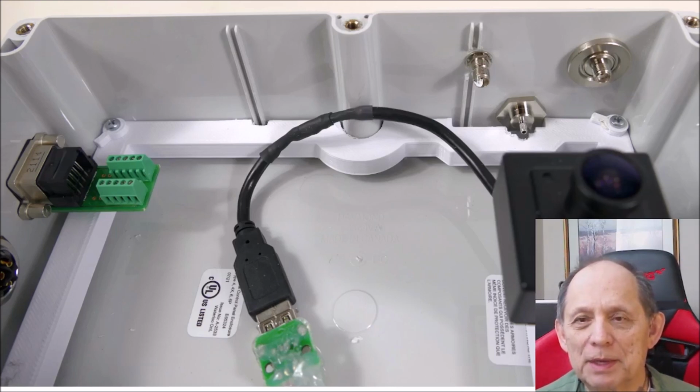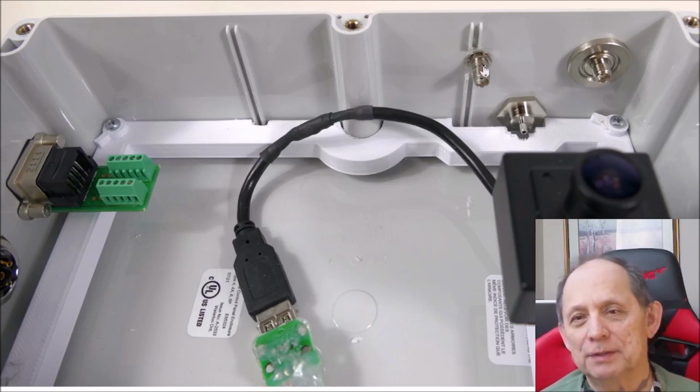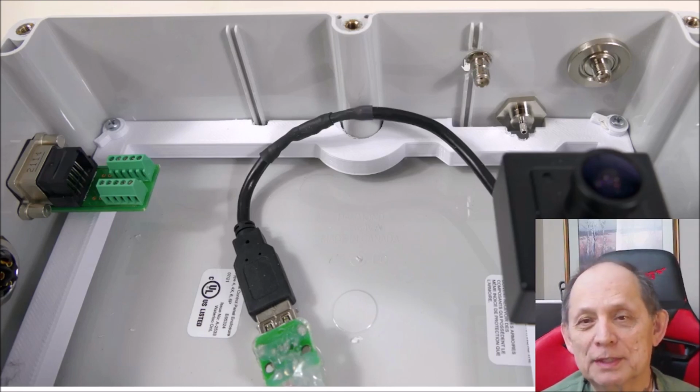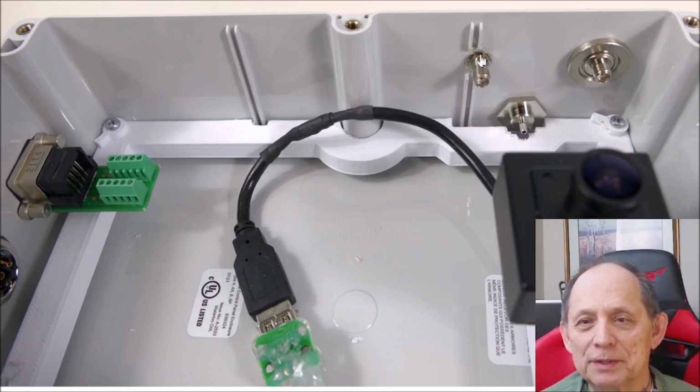This connector is an SMA connector to MCX connector through a bulkhead. Now, normally you would put the SMA on the outside, I think. But you notice that these ribs here, which are meant to house circuit boards, if you have circuit boards that you want to put in the box, I had to carve the ribs out where this connector is. So although Hammond drilled a nice hole, or machined a nice hole, for this thing, they left the ribs there. So in cleaning out the ribs, I'm not sure it was totally smooth, but I want a really smooth surface for the gasket. And the gasket mounts on the other side. So I put the MCX connector on the outside just to make sure I got a good seal. And we'll have a look at that in a moment.